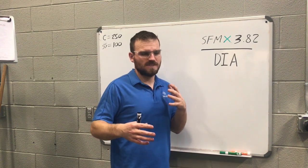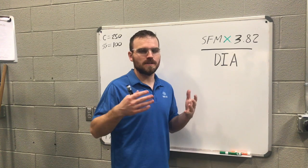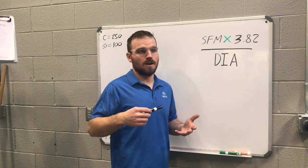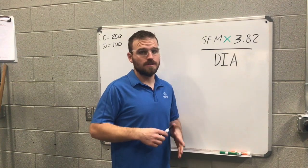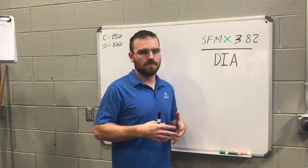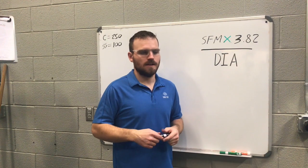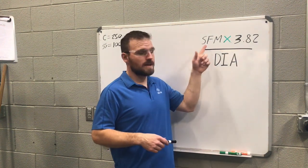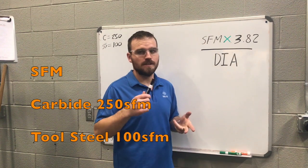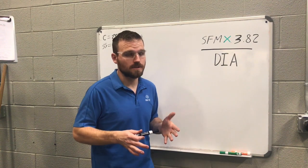Those are just the numbers that I've found work. It definitely changes if you're running on steel versus brass versus aluminum or even hardened steel. So these values are just going to get you in the area. You can talk to the manufacturer or look up other sources if you're working with some odd metals. To summarize: carbide is 250 SFM, tool steel is 100 SFM — otherwise consult the manufacturer.